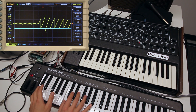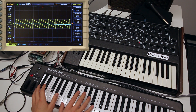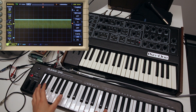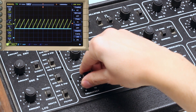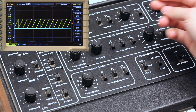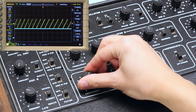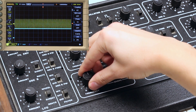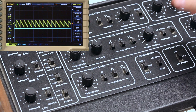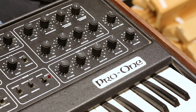The frequency control voltage can also be made to move slowly or glide between notes, or it can have another signal added to it by the modulator block. This third non-audio oscillator operates at low frequency, and is thus called an LFO. When patched into the oscillator's control signals, the pitch sweeps up and down at a frequency of the LFO to produce these alien sounds. An envelope is also provided for general modulation use and for the filter. The modulation signals operate on the same 0 to 10 volt inputs as the volt per octave frequency scale, but it's hard to say what the scaling of the mod depth really is.